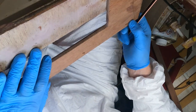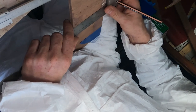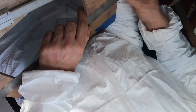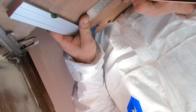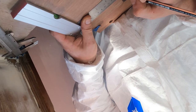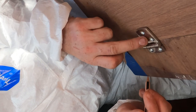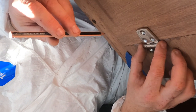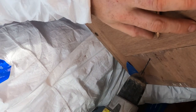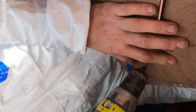It's really important with plywood like this to drill the forstner holes from one side and then flip it over and drill from the other side, because otherwise you get really nasty tear-out which is not fun to deal with in the filling and sanding process. I was also pre-drilling all the hinge holes and marking those out properly. It sometimes feels dispiriting to be dry-fitting everything in bare ply and then taking it apart again, but in the end it works out much faster than guessing or hoping that once everything is painted it all goes together as expected - because in a boat nothing quite works like that.